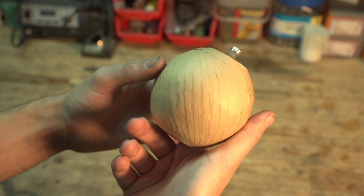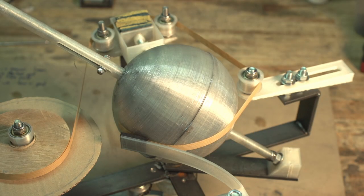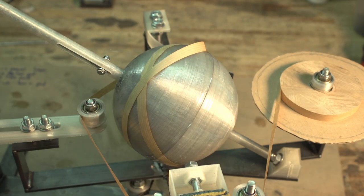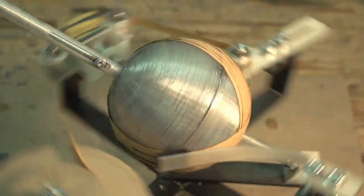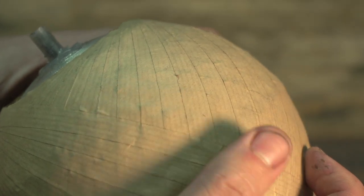The tape seemed to be evenly spaced out and the surface was nice and smooth. Although the tests worked great for 3 and 4 inch shells, when I tried pasting a 6 inch shell, the stepper motor didn't have enough torque to resist the counter torque of the pasting assembly. So I gave it a little extra juice and achieved pretty much the same results as before.